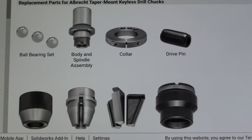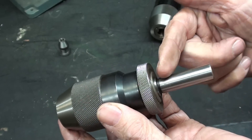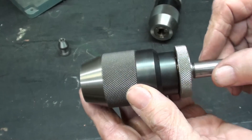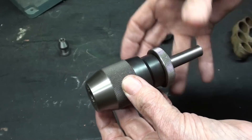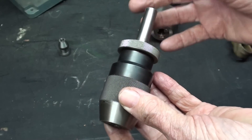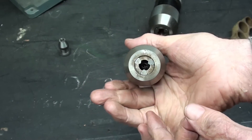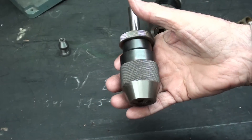Spare parts in the catalog would be outrageously expensive and difficult to install, so do not bother. Here's a short description from the catalog: a self-tightening design causes these chucks to grip tighter as torque increases, which prevents tool shank slippage and allows for precise drilling. This is the one I like to use in the Bridgeport mill with a straight shank, half-inch. When you tighten it, you can hold one knurl and twist against it. On the mill I just step on the brake and tighten it as tight as I can — they won't come loose if they're in good condition.